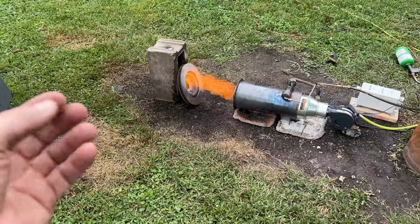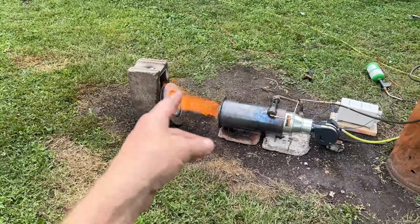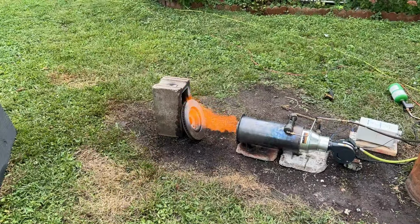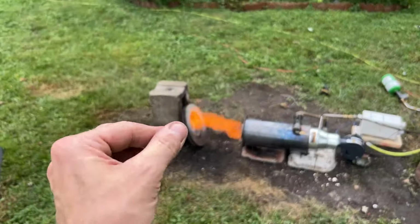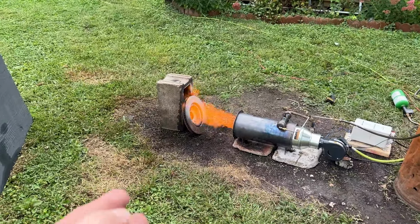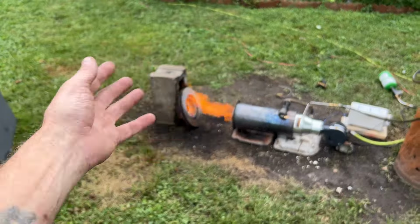Right around 600 degrees, objects start to kick off a lot of infrared heat, sometimes more than the flame itself. A blue propane flame doesn't put off anywhere near as much heat as a yellow flame like this. But a thin piece of metal or something that will glow red hot from the flame hitting it will increase the performance. You may have seen this tactic being deployed on the old kerosene heaters, where the kerosene flame is allowed to get that wire mesh on top of the wick red hot. That's kind of what the flame target does. It causes a piece of metal to glow. Glowing metal puts off more thermal energy than convection, meaning the flame actually touching it.